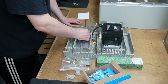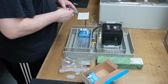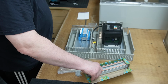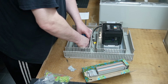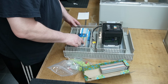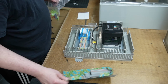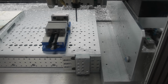And here as well a row with a few relays and terminals as interface for the main controller cabinet and the spindle. I have an ATC spindle and the relays are mainly related to safety features driven by the 3 piston position sensors of the spindle and the VFD frequency. To avoid that the spindle starts unless a tool holder is correctly inserted in the spindle, and also to avoid that you can eject the tool holder while the spindle is still running, just in case you accidentally push the release button at 30k RPM.